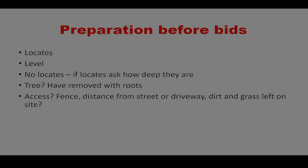If you are going to put the court where there are locates, go out when the person is marking — they'll be marking your cable, gas, electric, and water. With my experience, I've always been able to ask them how far down everything is. Cable is the number one thing to worry about normally, because gas lines, electrical, and water are usually deep enough that they shouldn't be a concern. But it's possible an older house or a lazy install means something is shallow, so it's good to ask.